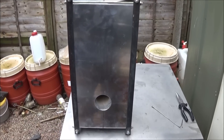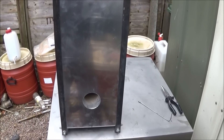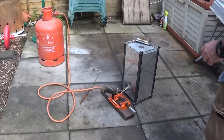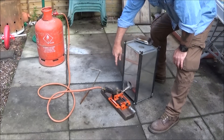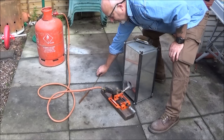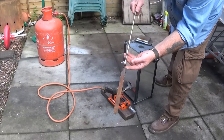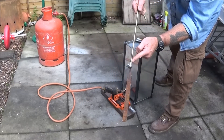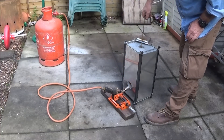After a couple of hours of cooling, the cold chisel will be ready to machine. This is how to set the forge up so it's hands-free. I'm going to anneal this old file - I've just connected it to this piece of rod with a jubilee clip so that it goes down and then in there like that.